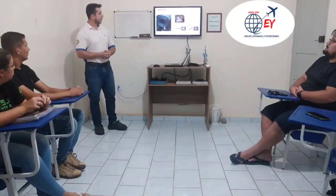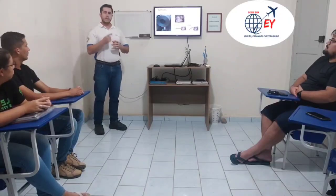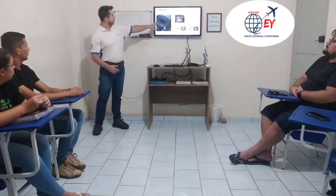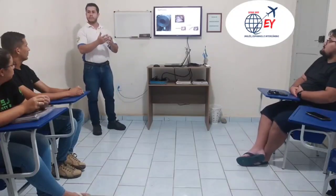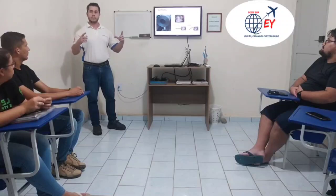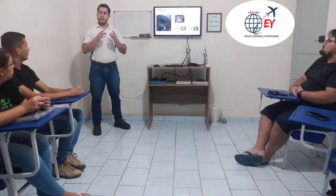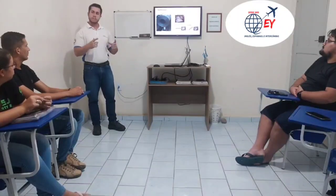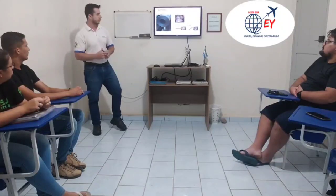Well, the first process is the cut process. We receive the steel coil. The steel coil is this. And the steel coil is cut in strips, rectangular strips and circular strips. Rectangular strips are for the lamination process, and the circular strips are for the stamping line process.